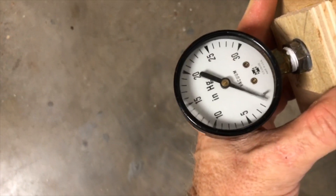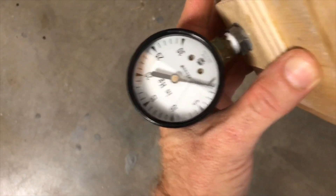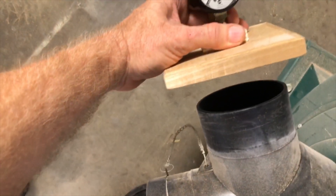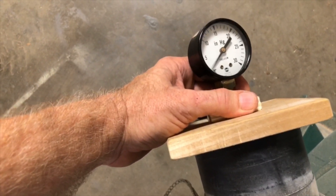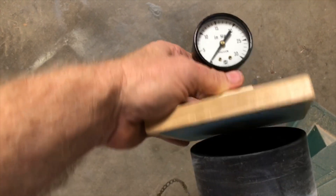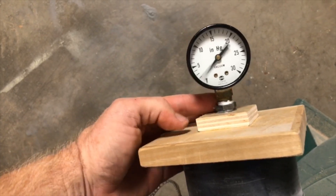It's literally pulling no vacuum at all, which is amazing because it will suck an amazing amount of material through the pipes and into the bag. So what gives? Why won't these machines pull a vacuum? The answer is actually simple: these machines don't suck — they blow. They're designed not to create high vacuum pressure, but to move a very large volume of air. They're not really vacuums at all — they're blowers. You cannot use a blower to do the job of a vacuum pump. Thanks for watching. I hope this video saves you the pain and suffering I went through trying to rig up a vacuum chamber that would actually do the job.